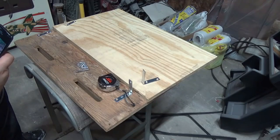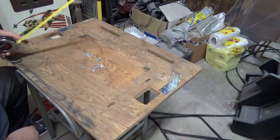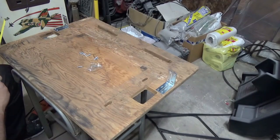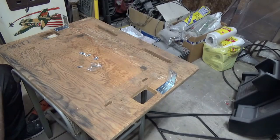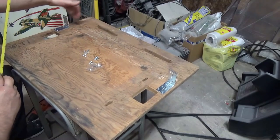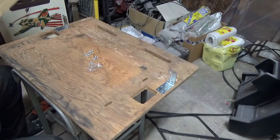He sent me a measurement — this board starts six inches from the back. So I'm going to start measuring it six inches from the back. I used brackets here and here on this side, figuring out where the monitor is going to be. The correct measurement from this upright board is six inches, so I went six and three quarters — that's where this line is. The reason I did six and three quarters is because the board we're putting in is three quarters of an inch.